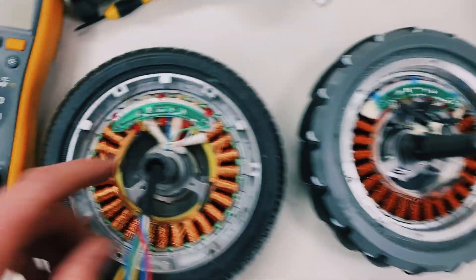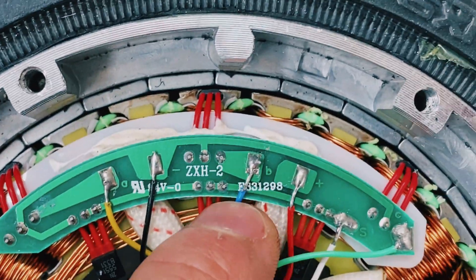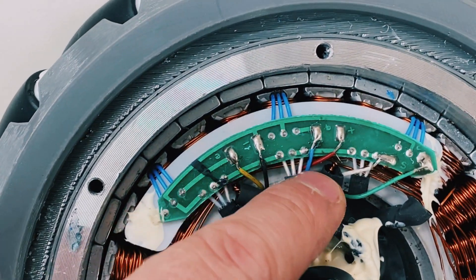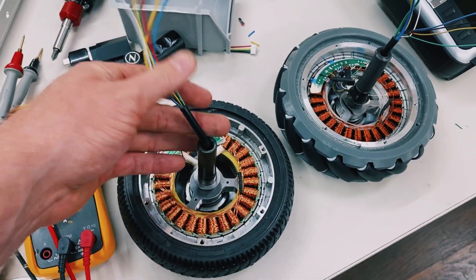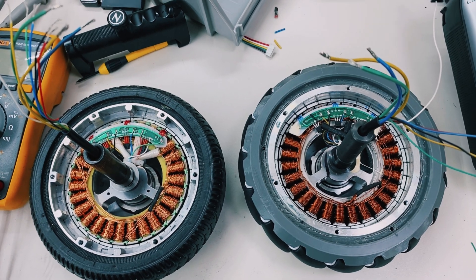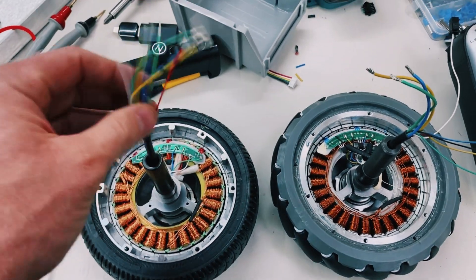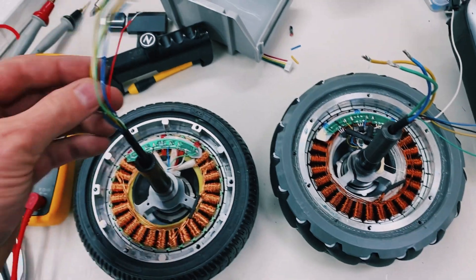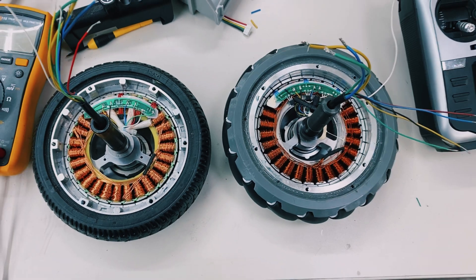What's weird is if you look at the board on both motors, yellow is A, blue is B, green is C — same on both. So I believe this was just labeled incorrectly, or not all A's and B's are created equal. Just keep that in mind if you have different varieties of hub motors: if you have any weird behavior like I was showing, you might just be able to swap the motor phases and the Hall Effect sensor phases and you're good to go.